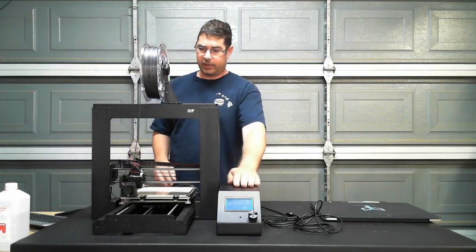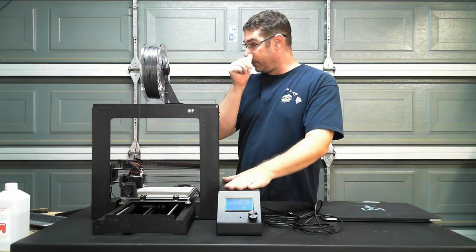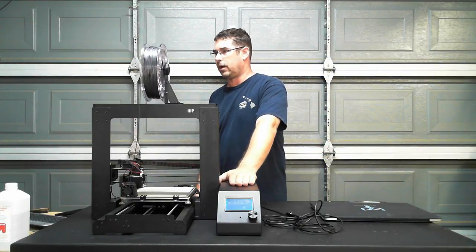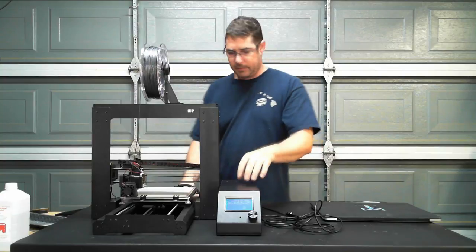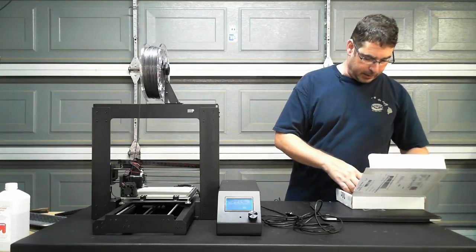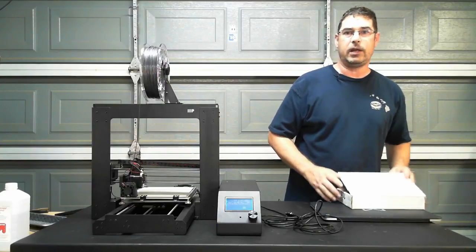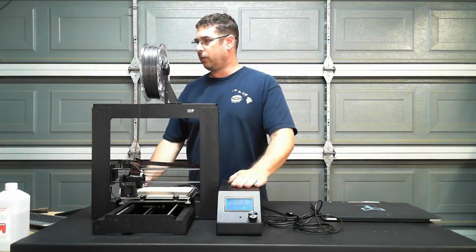All right. So while this heats up to try to print, let's summarize what we did for the people that weren't here at the beginning of the stream, and some of the known items about this particular upgrade. For those that have been with us the entire time, bear with me for repeating it. What we did is we pulled out the Melzi board that was in here, which has fixed, limited firmware and limited capabilities, and the LCD. We pulled out both of these, and we replaced them with a Cohesion3D Mini board, which runs Smoothie firmware. Ray from Cohesion3D has been in the chat.